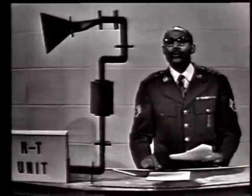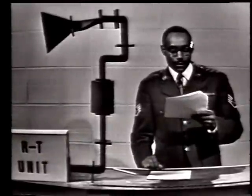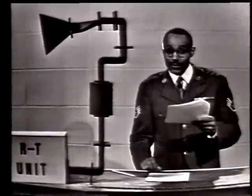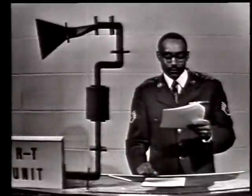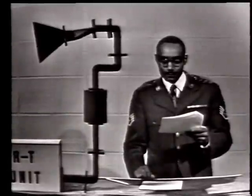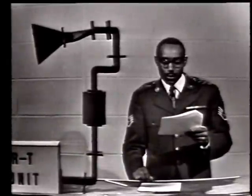Now, the purpose of the rotating joint is stated under item 3 of your TVI guide. Let's complete this item. The rotating joint enables us to connect a rotating section of the waveguide to a stationary section electrically, yet keep them separated physically. Electrically goes in the first blank, physically in the second blank. You will also note that the electrical characteristics of the rotating joint are identical to those of the fixed choke joint.